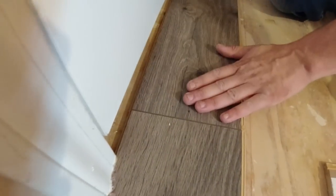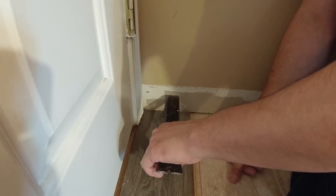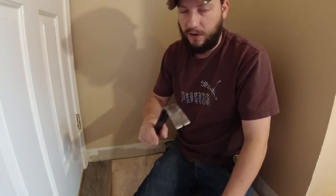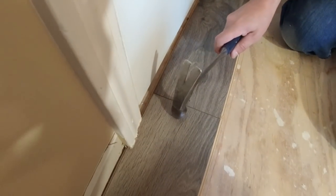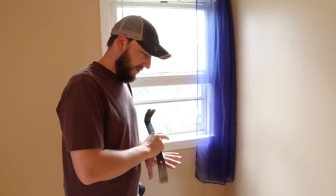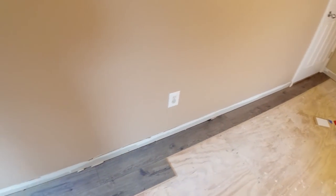You should be able to just drop these in and push them tight where you want them to go. But if there's a gap and you wanted to make sure these were tight, you can take a pry bar or a flat bar and pry it against here and just give it a pry. And another little tip — if it's not going, you can hold this like this and then come back here and give it a little tap and it'll pop right into place. All right, we've got our first row started. We know we want to stagger our seams, so we'll cut those nice and random. We know how to cut our end pieces and we can go to town now.